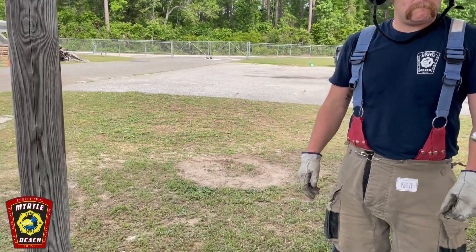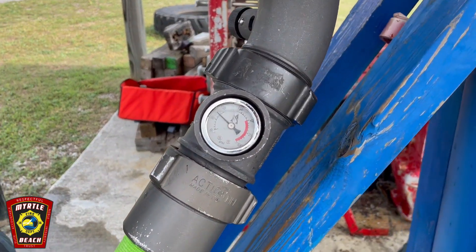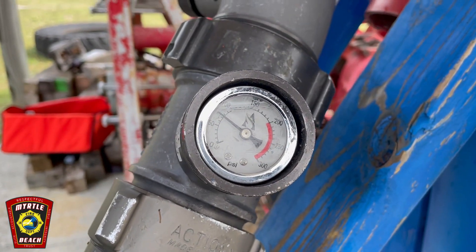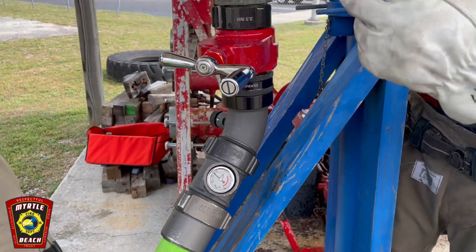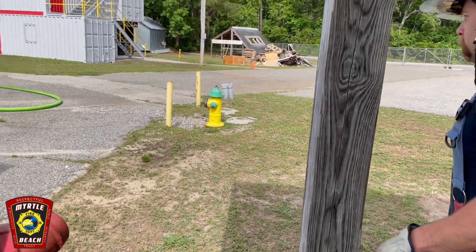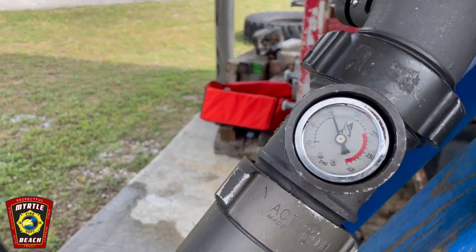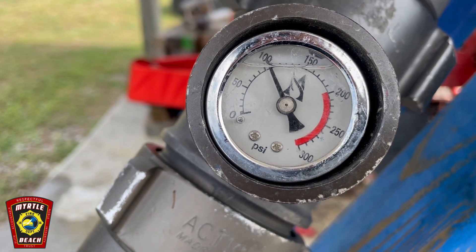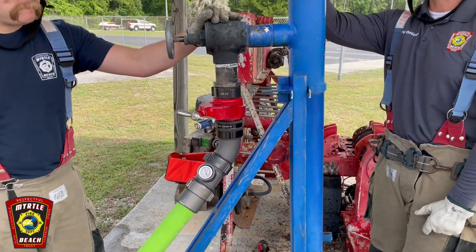Prior to flowing, with the nozzle open, we want to test and see what our flow pressure is. Right now we're at about the 60–70 PSI range, which is good for the one inch tip. If the nozzle shuts down we'll have the static pressure of what's in the system — almost hitting 100 PSI. That's not a true pressure, that's more of a static pressure. What we want to know is our flow pressure once the nozzle is open, and we can set and restrict it using the gate valve. That's basically the setup on an outlet.